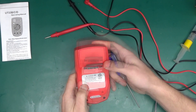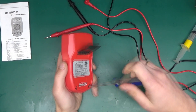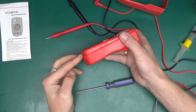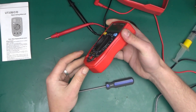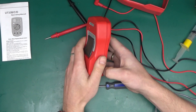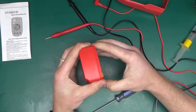The multimeter has been Intertech tested — not UL — Intertech is slightly less stringent, but nonetheless it's got some sort of testing certificate. There are two screws holding it. Inside, there is a huge lip going across the inside of the multimeter — not just a gap but a very large lip — which prevents plasma from escaping in the event of a catastrophic internal explosion. They've made an attempt to contain any damage if you were holding this palm-sized device.